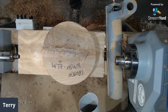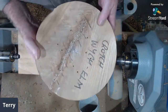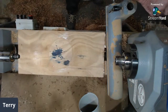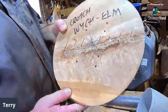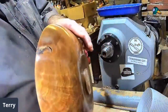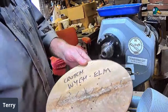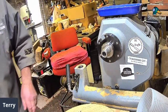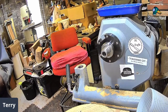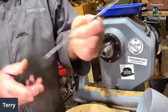The reason Terry leaves shavings on his floor is to disguise the holes! I can see it better on the other camera — switching cameras now. It's wood glue: the shavings are forced into the inclusion with ordinary wood glue, forced down, more wood glue, et cetera, et cetera. To get to the bottom — I think it's about an inch deep — I use this little dental pick.